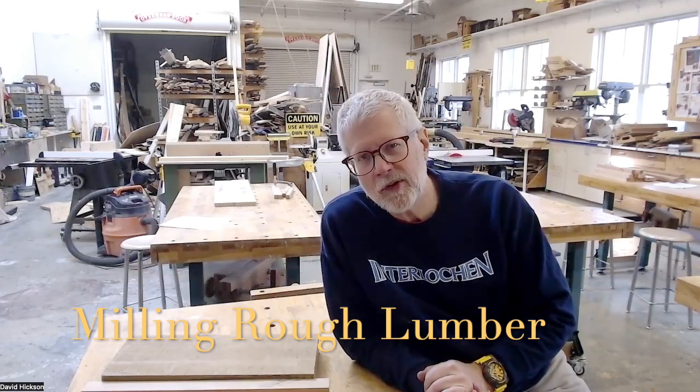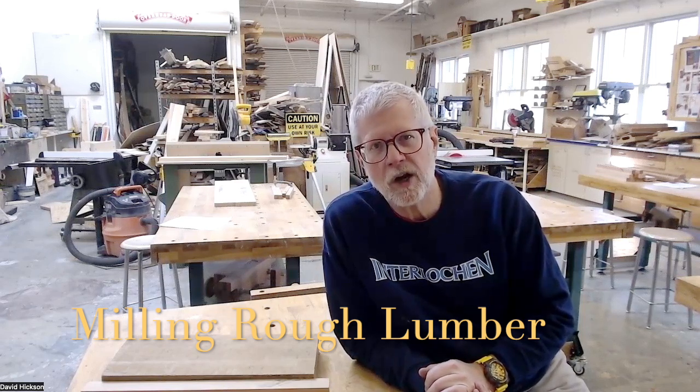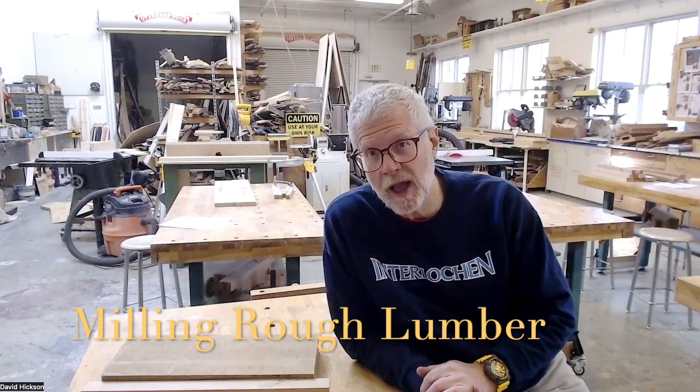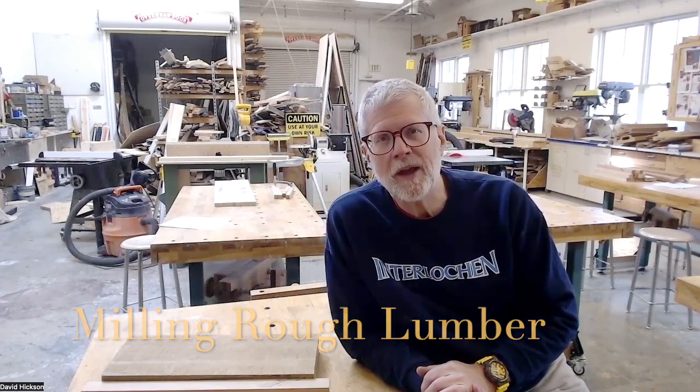Hi, my name is David Hickson, and I would like to share with you today some information about how to properly mill lumber. By milling, we mean the process of going from rough sawn boards, which might have kinks and warps and cup and all kinds of misshapen surfaces and shapes to them. And we want to mill those down to boards that are nice and straight, have parallel faces and perpendicular edges that we can use then to make our furniture.